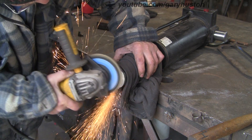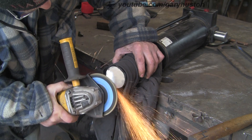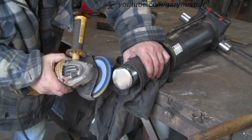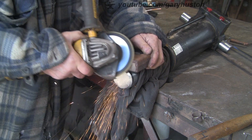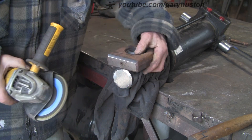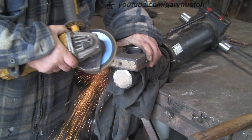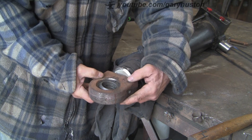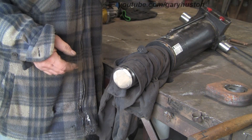I'm surprised - I cut that quite square with that disc. It doesn't need an awful lot of cleaning up. This has already got a bevel on it, so I'm just going to take the rust off, get it nice and clean and shiny. It's going to be a bit of a peculiar one the way we weld this on, but I've done them before like this and they've all worked. Let's stand her up, get it tacked up.